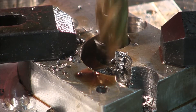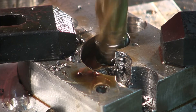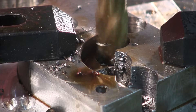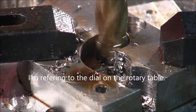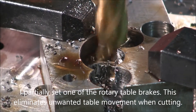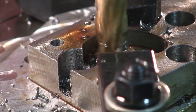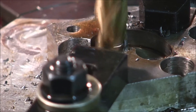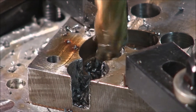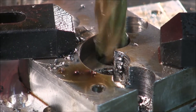I'm milling an inner radius on this workpiece, simply taking 50 thousandths of cut and going from — I've got the table marked from 39 to 161. That's all there is to it. I like to have a little drag on the table. I think that would have been a lot better if I had actually plunged my 50 thousandths instead of just talking about it on camera. We'll do it this time.